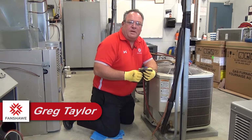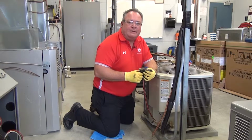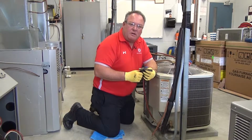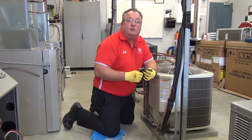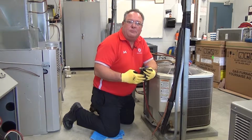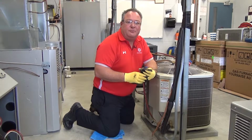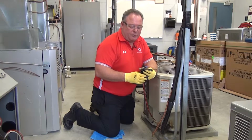In this video, we're going to be doing Schrader core removal. A lot of times the tire valves or the Schrader cores in the air conditioning system tend to leak. In years past, we had to take all of the refrigerant out of the system to change the actual Schrader core itself, which was an environmental hazard. The other thing that would happen at that point, we'd have to re-evacuate our system and then refill it with refrigerant once we were done replacing the tire valve or the Schrader core.